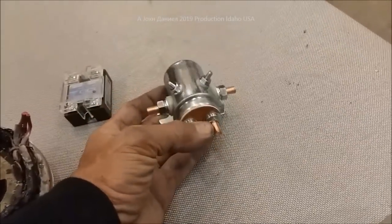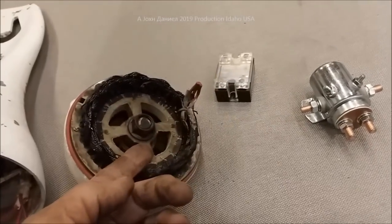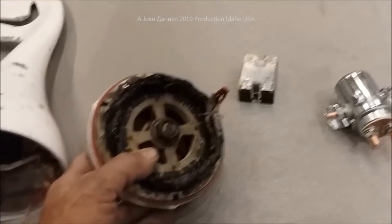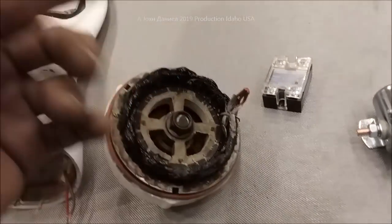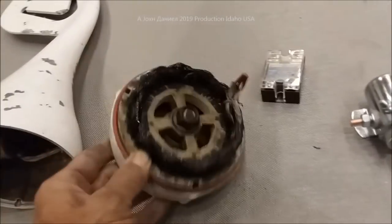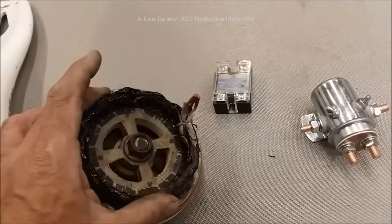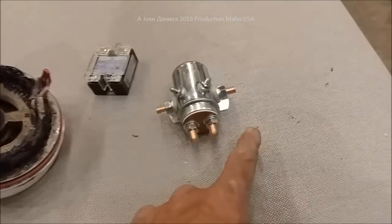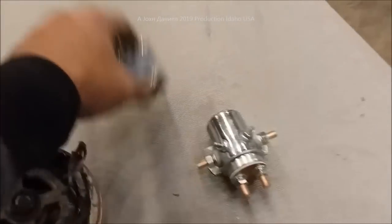A lot of people think this is a good item to use — look at the results. His wiring wasn't heavy enough; he only used six-gauge wire, and it burnt and blew the fuse. He was lucky — they smelled plastic burning and shut everything off. But it was too late; it had already eaten that up. And when the controller fails, the turbine overspeeds.